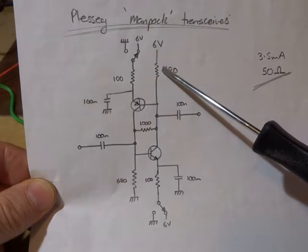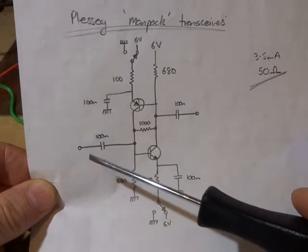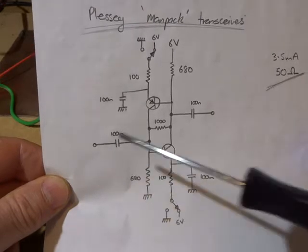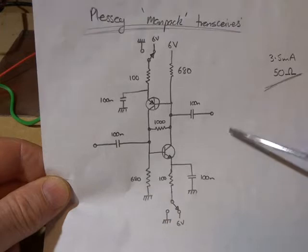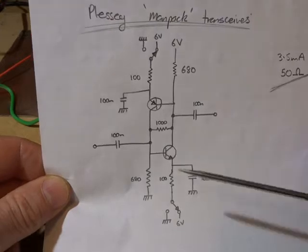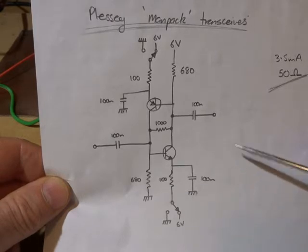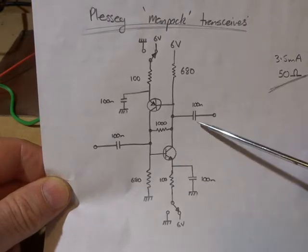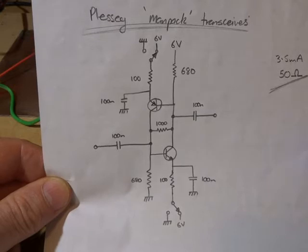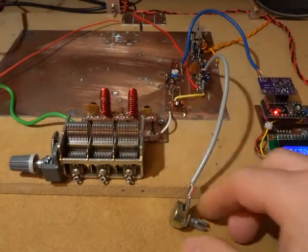It'll be interesting to see — if I do that, maybe I have to sacrifice that 50 ohms and just have a matching transformer between what should be the bandpass filter on one side, then the mixer, and the crystal filter, and vice versa on the other side. So it's something to play around with, and I'll probably utilise LT Spice to do some simulations and try to work out maximum power transfer for any variations in the biasing voltages. Anyway, just a quick video to cover that off.